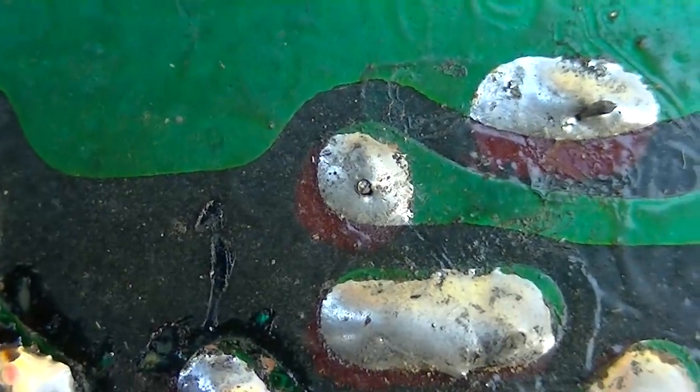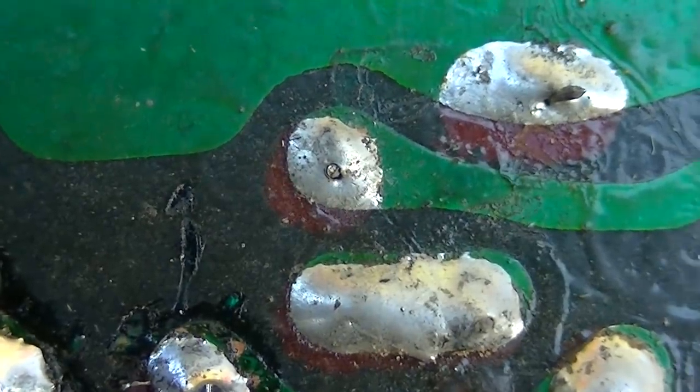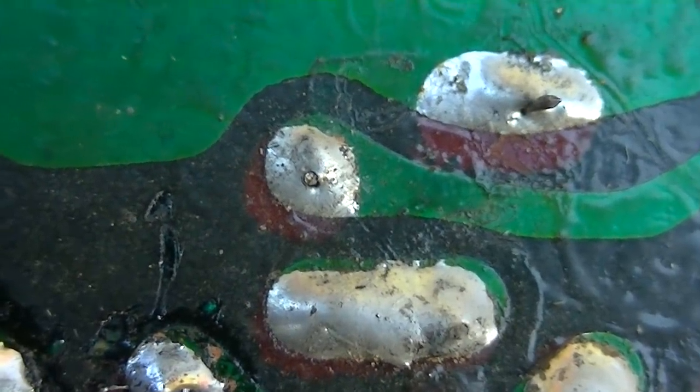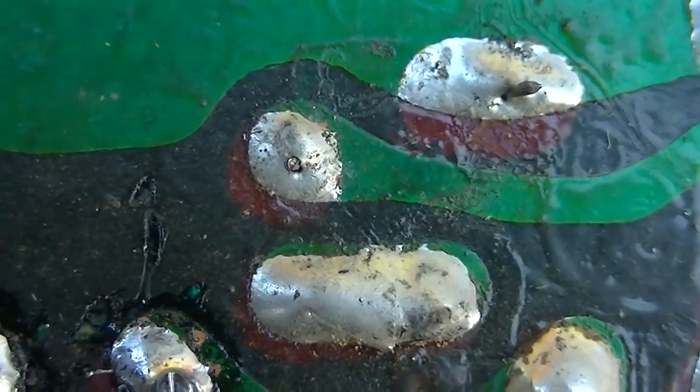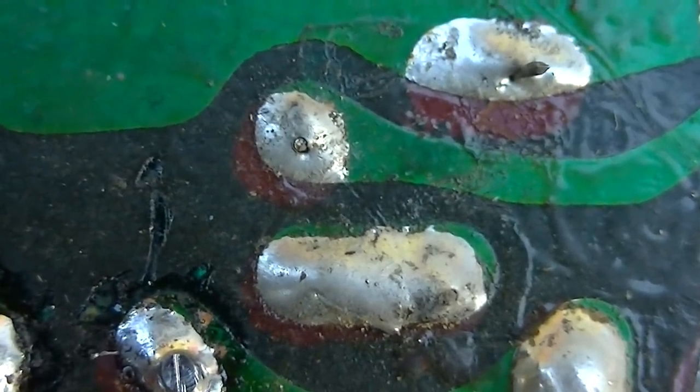Basically, it's that joint right there. I guess you can see it. Not as well, though. So I'm going to solder that. That should get the sound back in, but we still got these weird problems with the hum and IF and the detector.